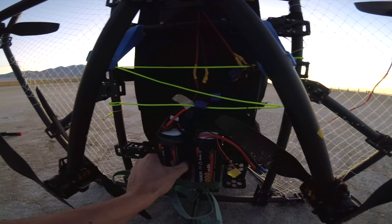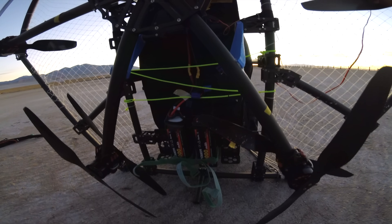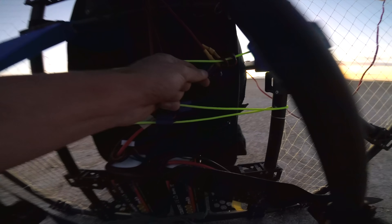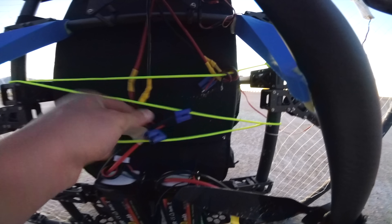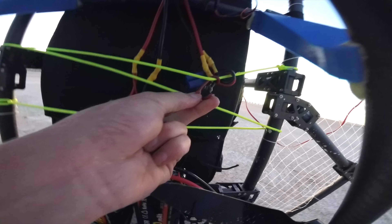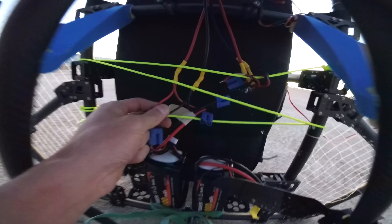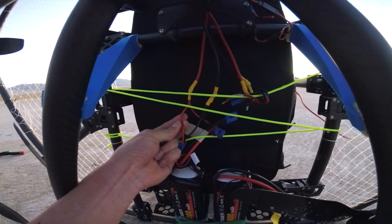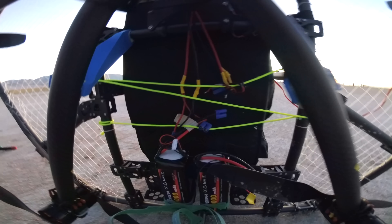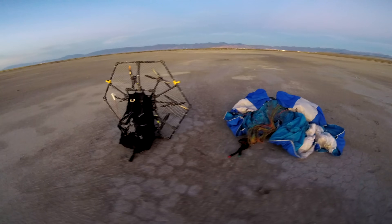My theory of what happened is these two 10Ah 6-cell LiPo batteries were being required to propel a person into the air. The wires got so hot that they definitely unsoldered themselves. I can feel that these wires are a darker red and the silicone is falling off. I had wire harnesses here for four batteries but was only using two — the ones that weren't plugged in are brighter red, and the ones pulling the current are darker red. I was just pulling so much power that the solder in the EC5 connector melted.